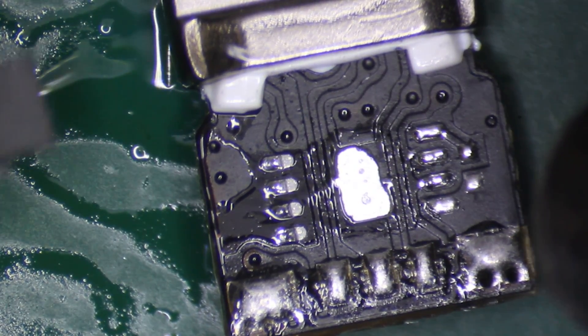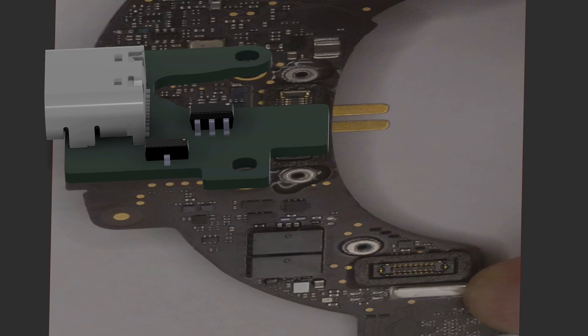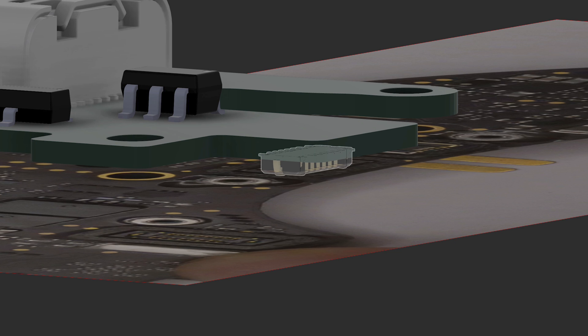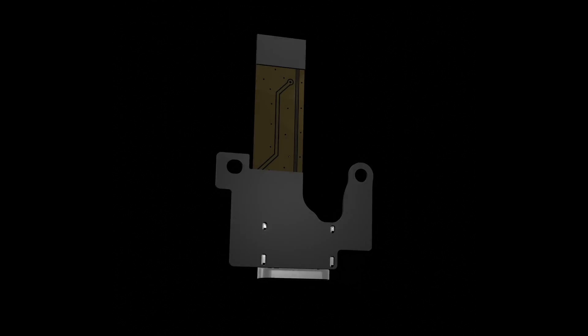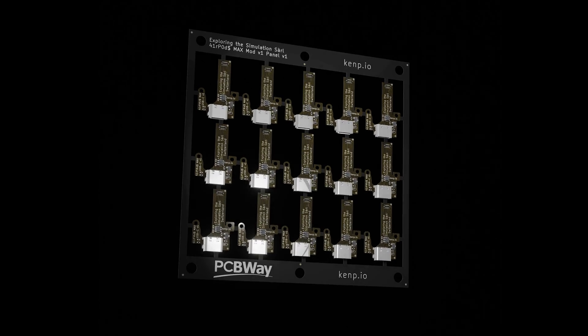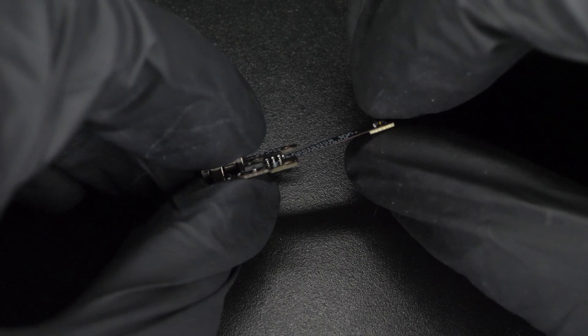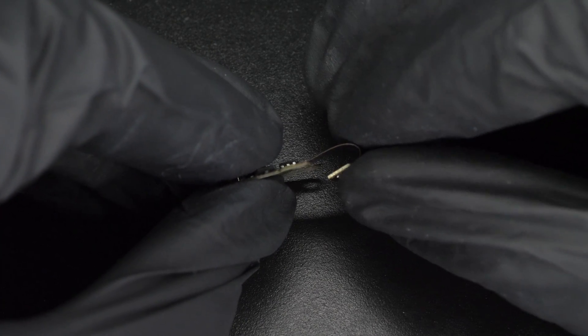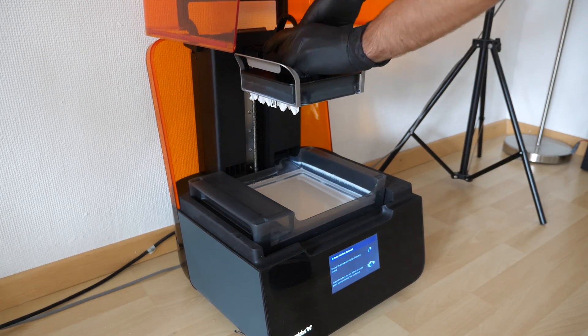If you aren't wired, there's better headphones out there anyway. I want to make this available to everyone, but there's one last thing that's been bothering me. I plug in the connector in this direction, my board is held by those two holes, and if you don't tighten it properly or the screws get loose, all the pressure will go to the B2B connector here and it might destroy it — so it doesn't look great from a durability aspect. Now the problem is fixed because we have a flexible part that separates the two rigid parts of the board. This way the force is not transmitted. Also, I improved manufacturability because all the components are on the same side now. Then I just 3D print a part to hold the microphone and we are done.